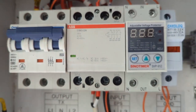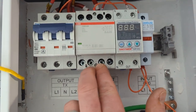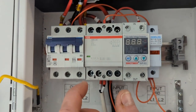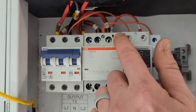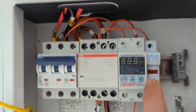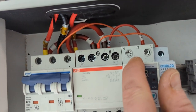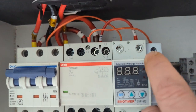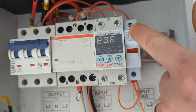So let's go over this quickly. We've got our 240 volts coming in down here to these two poles, they come out, and this is just like the factory setup — not much different going on. All we've really done is interrupted the A1 side of this contactor. Instead of it coming directly up, what we've done is put this voltage protection circuit in the loop. We pull some current off the neutral leg and run that into the neutral side of the voltage protector, and we're also looking at this hot leg here coming into the hot side of that voltage protection relay.